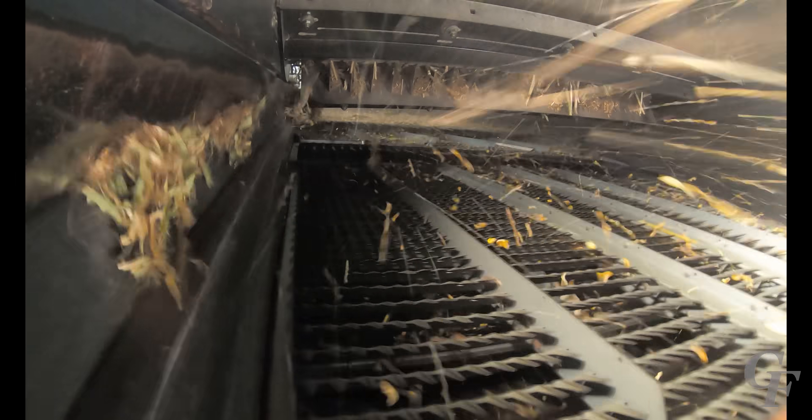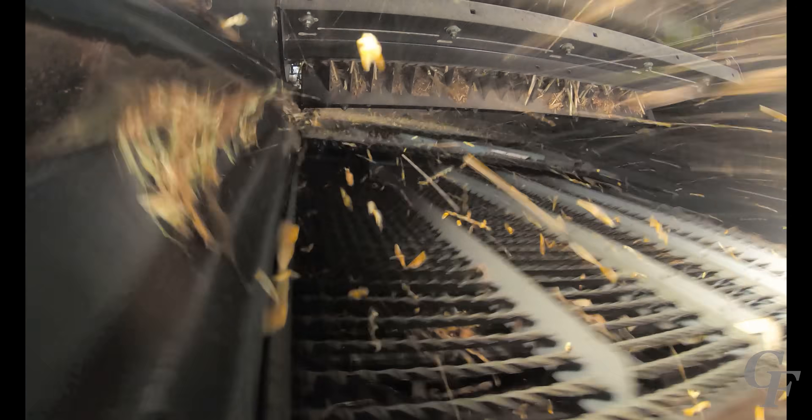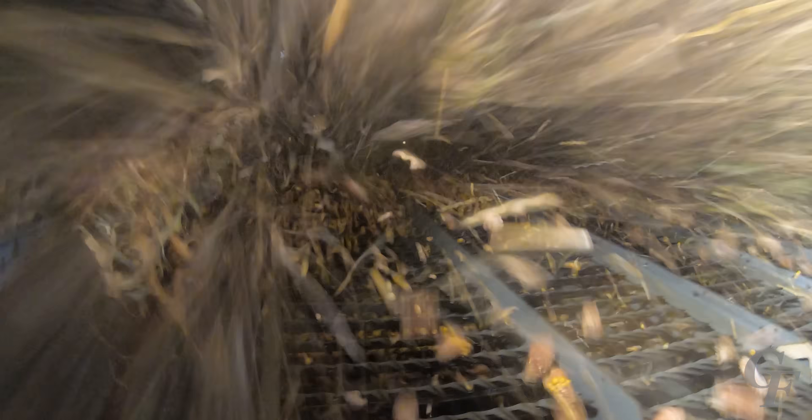The sieves are a two-stage cleaning process with one sieve on top of another. The upper sieve will keep the majority of the chaff from falling through. The lower sieve has smaller openings to catch any final chaff and keep it out of the clean grain. The sieves in this particular model are self-leveling, which keeps grain from flowing all to one side when the combine is harvesting on a hill and causing grain loss.